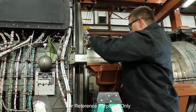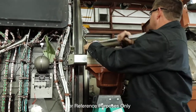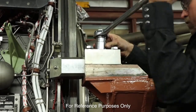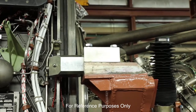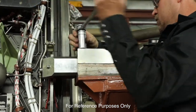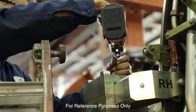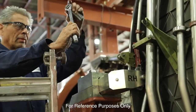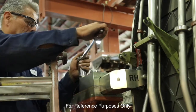The key is to tighten the center bolt, which requires an inch-and-a-half socket. That tells you that all four bolts are centered up on the head. Once that's tight, the mechanic will tighten the four remaining bolts, which require an inch-and-an-eighth socket. These just need to be snug tight — excessive tightening is not required. It's up to the mechanic if they want to use a battery-operated unit; that's fully acceptable. Go back in with a ratchet and make sure you can get them snugged up.